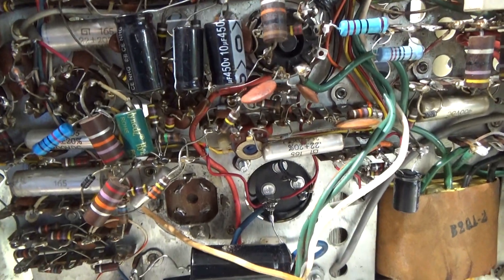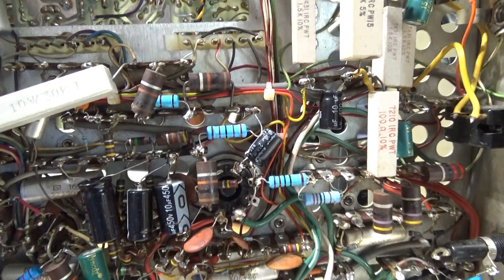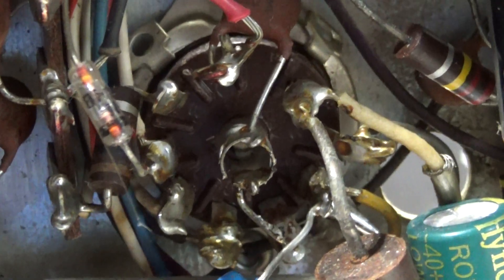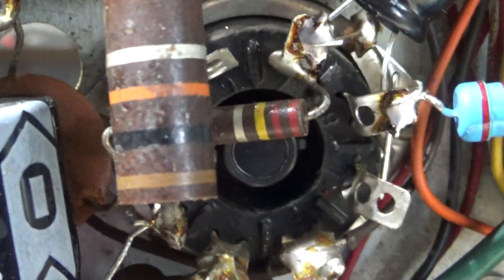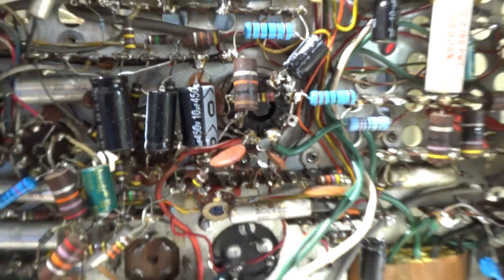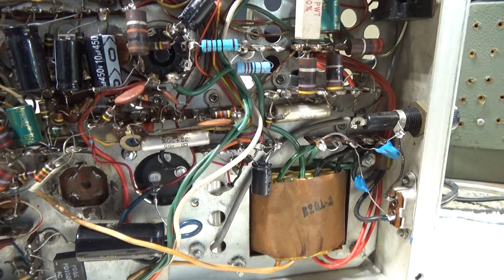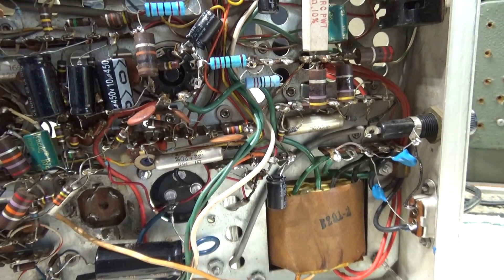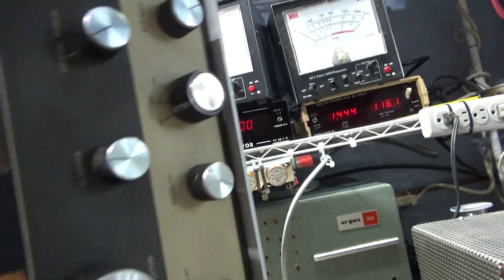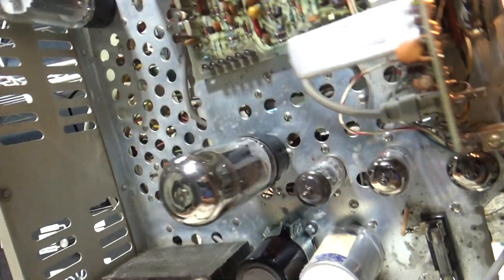The components are under the bottom, relatively cool - not next to the tubes. The tubes are not mounted on a circuit board; they're mounted directly to the steel chassis. Let me zoom in a bit - this radio is live. You can see the big audio tube mounted to the steel chassis, with point-to-point wiring. On all the next versions they used a lot of circuit boards, and most of the tubes were mounted to circuit boards with the parts mounted on top of the circuit boards next to the tubes.